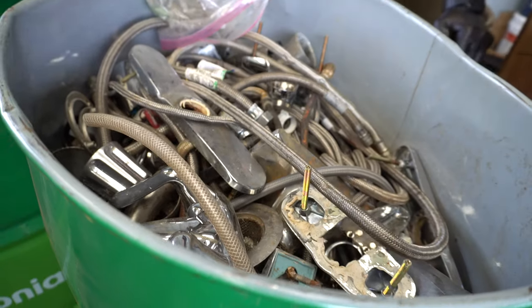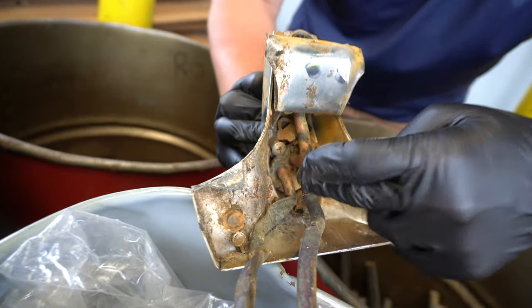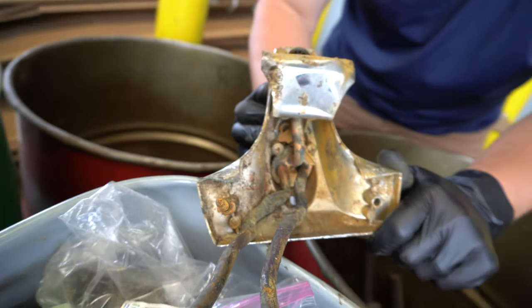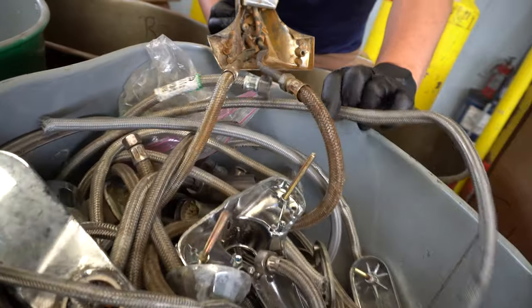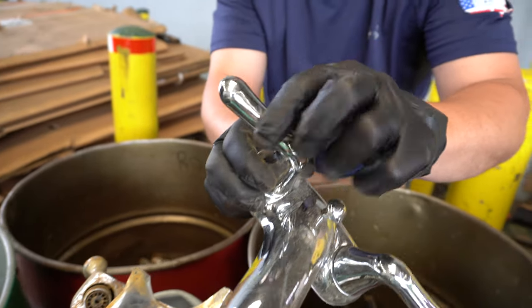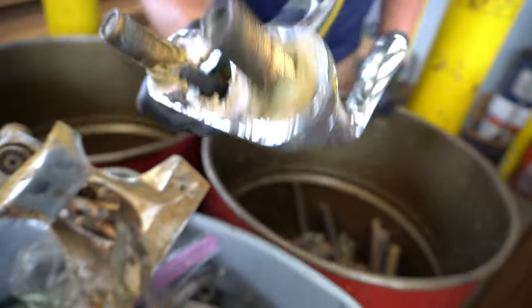Now in front of me we also have some different faucets. These are some of the new age faucets that come off of the new sinks, and a lot of these are die cast when you turn them over. Right here you're going to have a piece of steel, and underneath you will have a couple of pieces of copper. But this used to be brass — with these being made overseas nowadays, very often they're either die cast or some other low grade type of material. On top of that you're going to have stainless steel hoses attached, which you should always cut off. You want to pay attention because certain handles are going to be plastic, believe it or not. By taking it and scratching it with a file you're going to know, and underneath you're also going to see a piece of plastic and this different glue, which makes it a lower quality of brass.